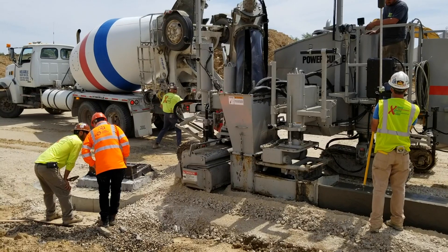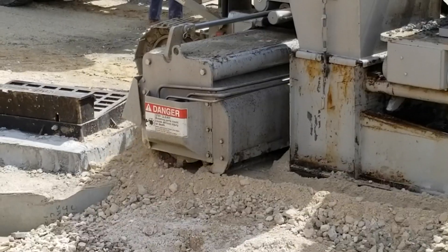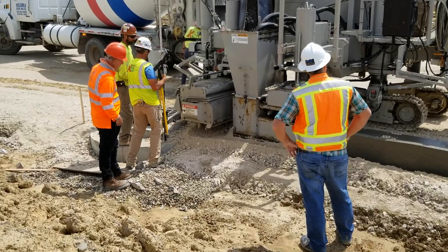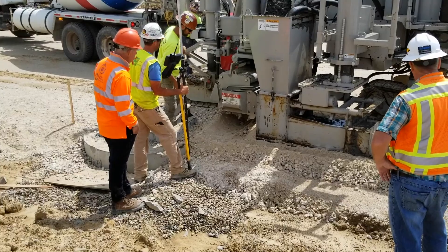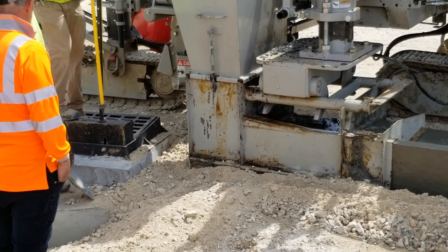The way I describe it is I can trim almost to where the trimmer touches the catch basin. Using the hydraulic capabilities of the machine, I can raise the trimmer and/or side shift it to the right and bring the mold hopper right up against that catch basin.